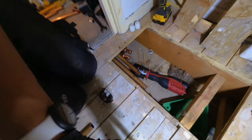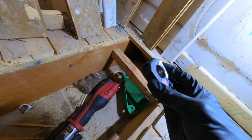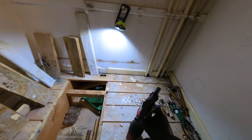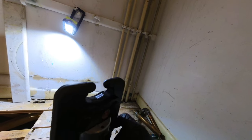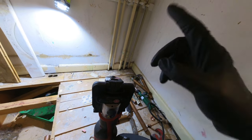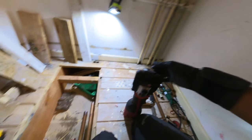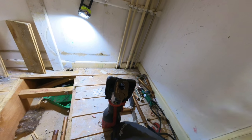That's been pressed — you can see it's got the crimp marks there, so that's done the job. The good thing about these is you can actually angle the jaws a full 180 degrees — that's how the jaws sit on there and you can literally angle it whichever way. The REMS ones you can only angle them up to 45 degrees, which would have been about there and wouldn't have worked here. But with these ones I can go the full sort of — probably more than 180 actually. So handy bit of kit.